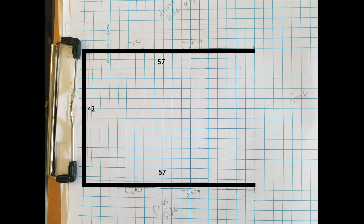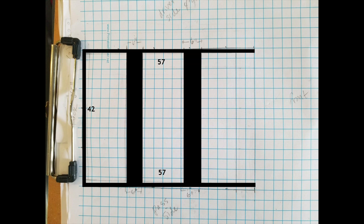Your base does not have to be as wide as your platform — you want a couple inches of overhang so you can pick up the platform and move the back piece up to access storage. The length is also not going to be as long as your platform. I decided on a 57-inch long frame and 42 inches wide. For this part of the frame I used two-by-fours. Based on measurements made with the platform in bench mode, I put two-by-sixes going across at two points: the first is 14 inches from the very back, and the second is 17 inches from the very front.